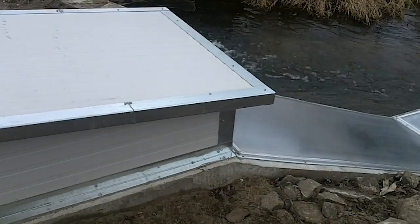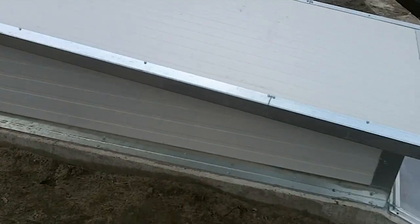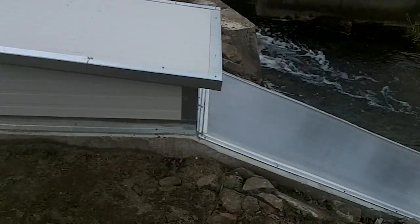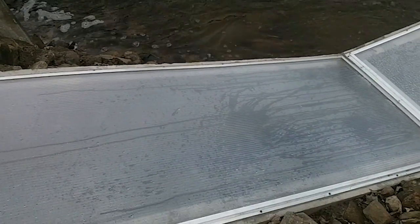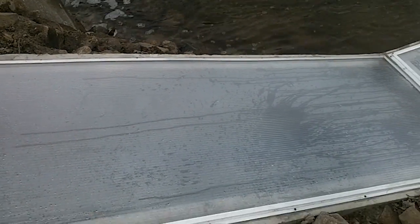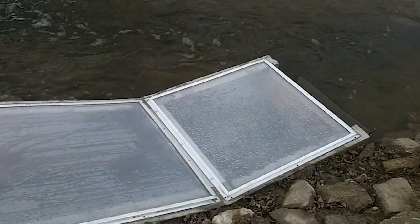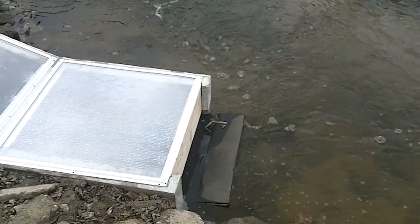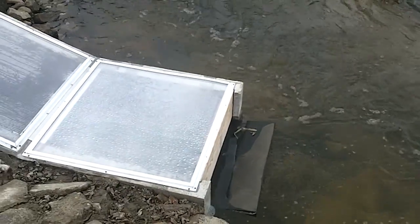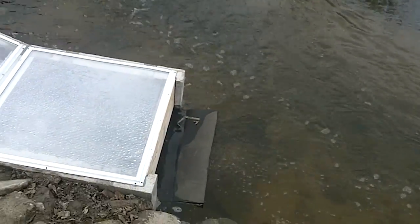So it's pretty simple. It's a concrete channel obviously running from the intake and then underground beside the dam. This whole unit is beside the dam. Then it goes down. The screw is right under this lexan lid — we have the lexan there primarily so you can see in there. As these get larger, you'd be able to stand in the small building up top and look down into the screw. We need it covered like this to control icing. And then at the bottom, there's just a flap that seals it up from the air and yet lets all the flow out no matter how much flow there is. If there's less flow or the stream level goes down in the drier seasons, the flap just goes down some.